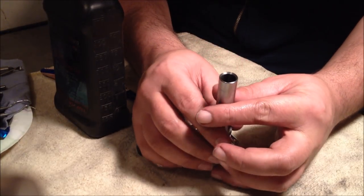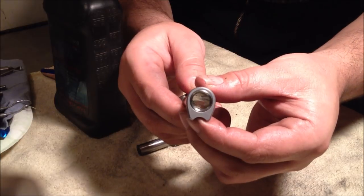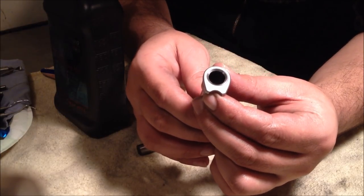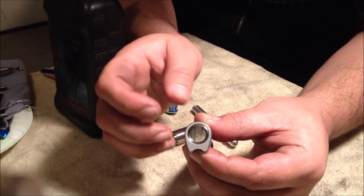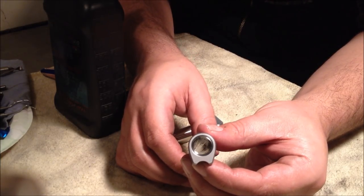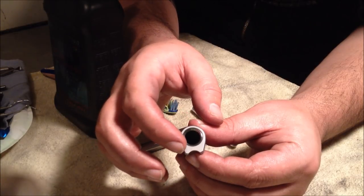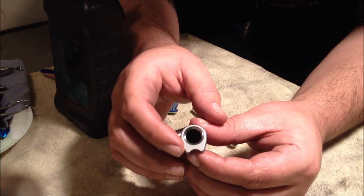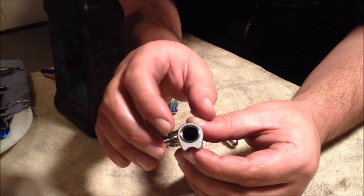Alright, I'm back about halfway through on this crown. Let's put this bushing on. See how that's starting to look pretty nice. A little bit more, we'll bring it right proud to the edge. Then you put the bushing on. You can put it in the slide with the barrel mounted into the pistol, and you'll cut just a tiny bit of this edge off where it'll just touch this bushing. You don't have to do it that way, but it looks the coolest when you do, because then it'll kind of melt perfectly in. You won't have any little flat spot on the face of this barrel.